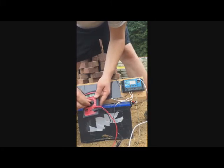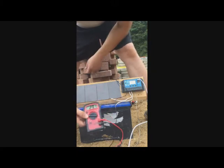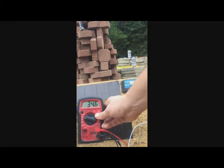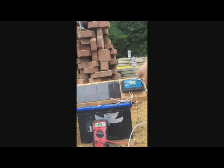So you've got to go higher to measure, and there it is. That's actually 28.5 volts, roughly 28.5. You put it down here about 30 volts. Cloud cover, give or take. 34.6 volts DC. And as you can see right here on the charge controller, it just runs. Like the Energizer Bunny, it just runs.